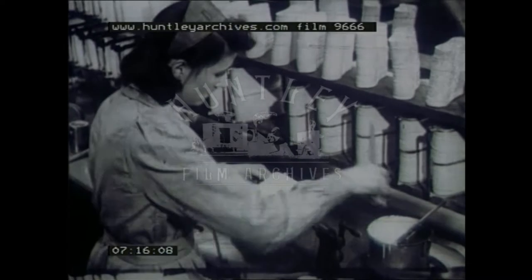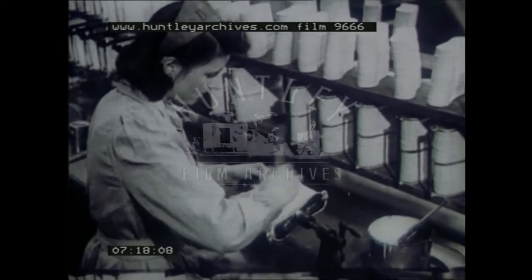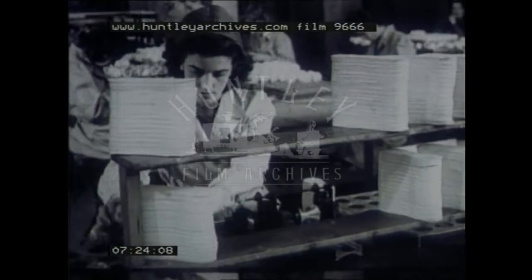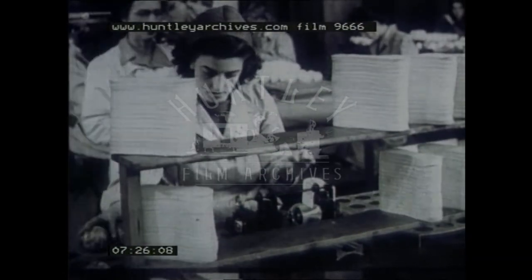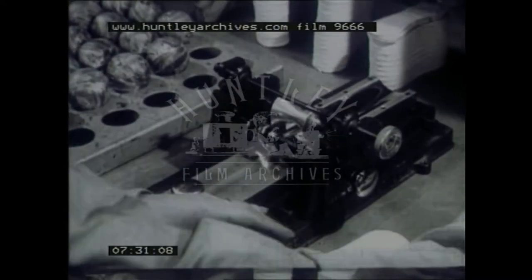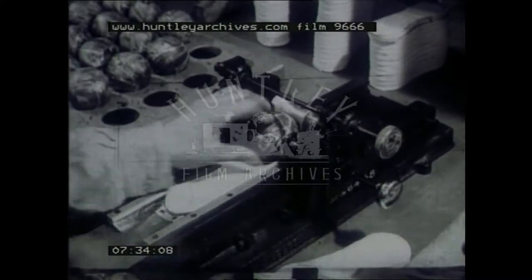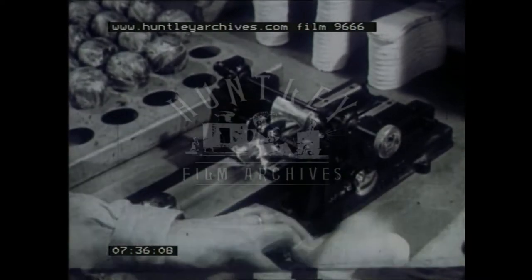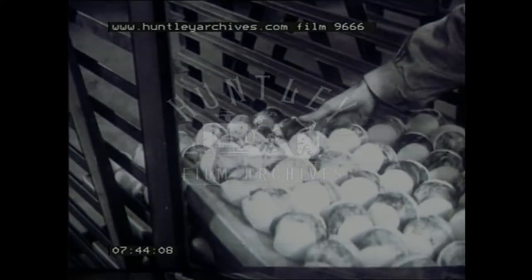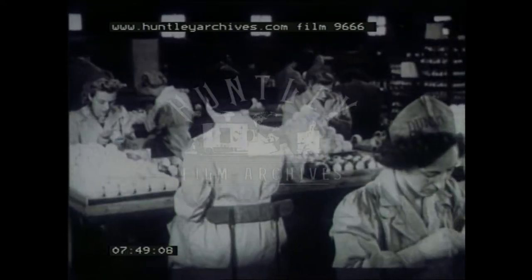After this, the blanks are tightly packed up into clips, 72 at a time, and the edges are given several coats of sticky solution. Now at last, the cores and the covers are ready to be brought together. The first blank is fitted to the core by machine — the sticky core is held in a clamp, and the blank, coated side up, is slid under and around it. The second blanks are applied by hand, the edges and wrinkles being smoothed down with a fitting knife.